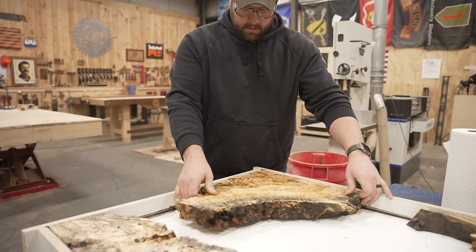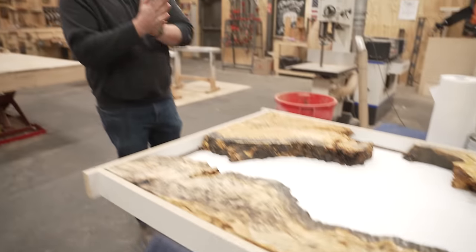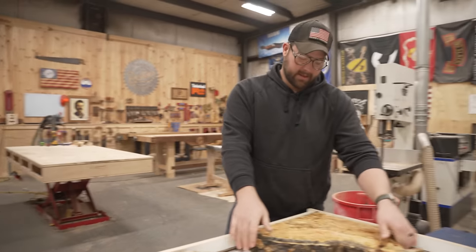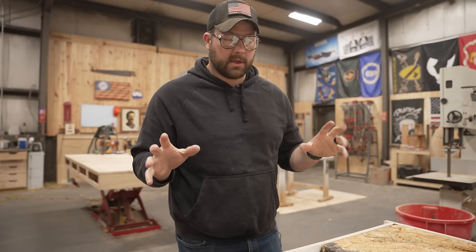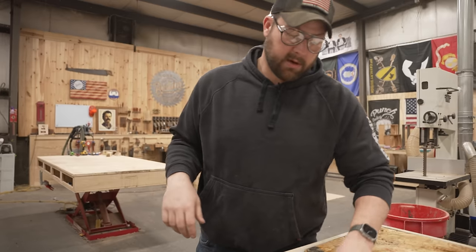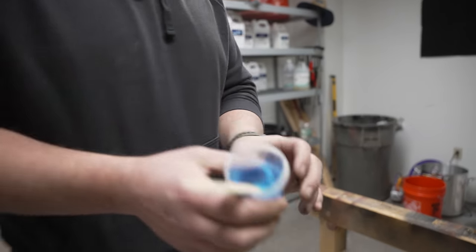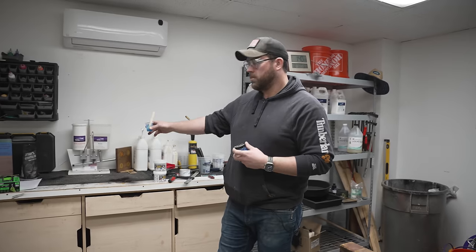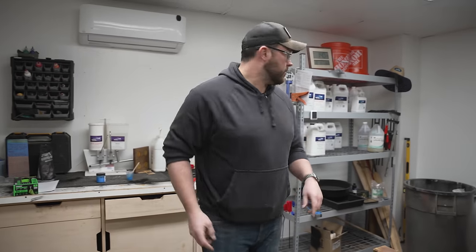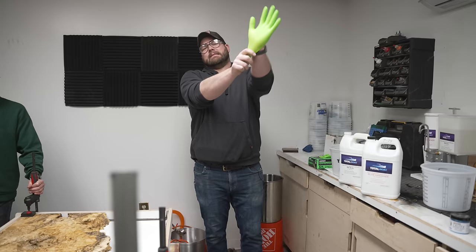I am so pumped to get these into the mold. They're placed — now we need to give Joe some options for the epoxy. We're going with this blue pigment — System Three's Cast FX dry metallic colorant. We're going to mix a base layer with Total Boat high performance resin, pour about an eighth to a quarter inch. That will harden overnight, and then after 24 hours we can pour the clear top layer to show all of the burl off. Let's mix.